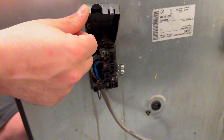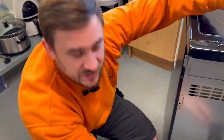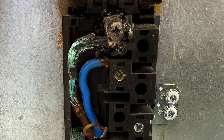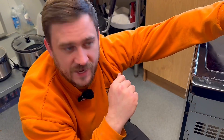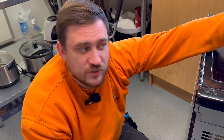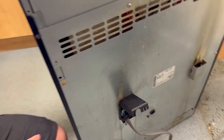It's either going to be a loose connection — under-tightened — or an over-tightened connection. Looking at this closely, I'd probably suggest it's over-tightened. In the close-up you can see the actual connection looks slightly twisted, so it might have been over-tightened and slightly broken — maybe where it connects onto a part of the oven, causing it to arc over time and cause this damage to the cable. Or maybe they over-tightened and ripped the thread slightly, and over time with the amount of current — we're talking many amps — in a commercial property where this oven is used most days for long periods, that could have caused this.